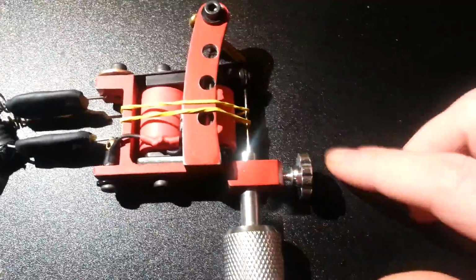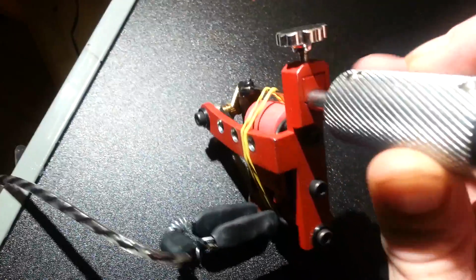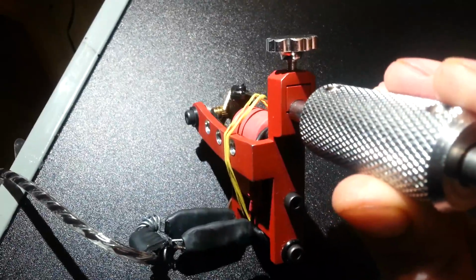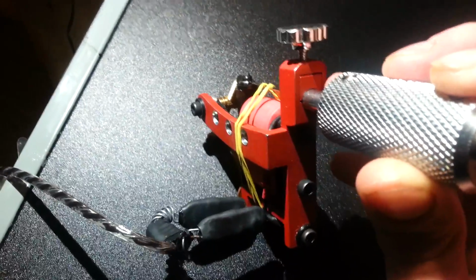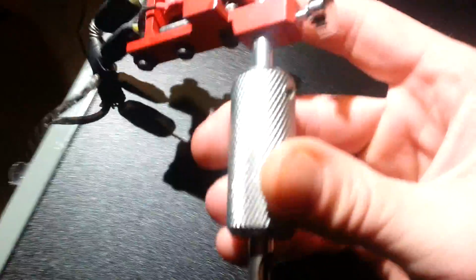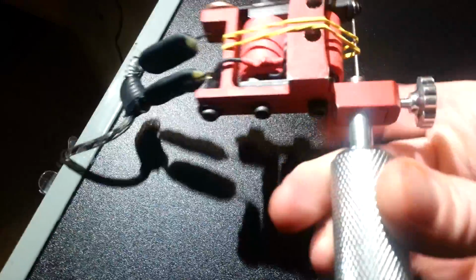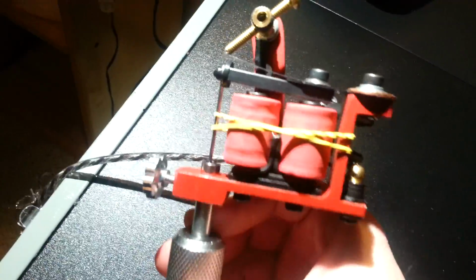And the other thing was the vise. This isn't a typical pinch vise that has a sleeve. I'm not sure how well you'll be able to see it, but there is actually a square cutout in the bottom of this vise. You see where it's a square right there? And that little piece actually comes out. That's what gave away that his machine was one of these frames. This is the only machine that I see that has a vise like this. They either have the pinch vise with the sleeve, or the push vise with the sleeve, or a pinch vise for most frames. And also, look at the front of the vise too. You see it's got the angles right here. It's also got that. Yeah, so it was a dead giveaway that he is using Chinese frames.